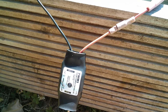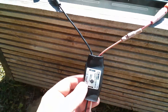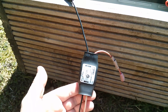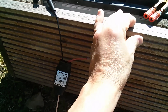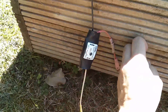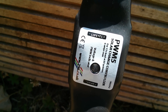You could understand someone thinking it has definitely broken. What's actually happening is that power coming from the solar panel is keeping the controller powered up. So when I disconnect power from the battery, the charge controller is still receiving power from the solar panel. I'm now in a difficult situation where I can only reboot this thing by disconnecting both the battery end and the solar panel end. Now it's completely lost power. If I reconnect the battery end, it does reboot and it's now modulating.